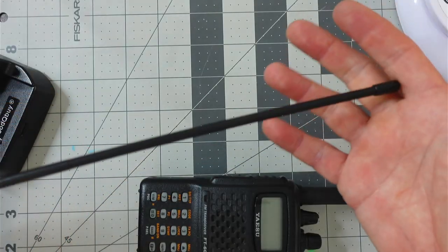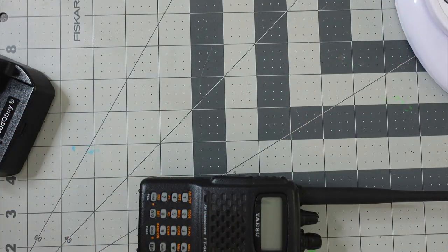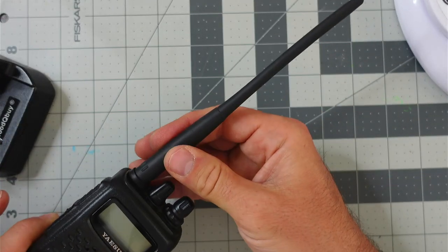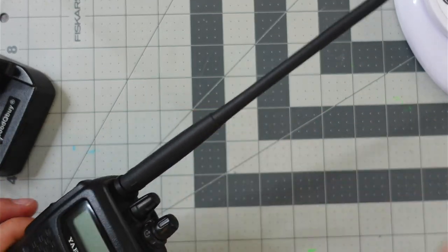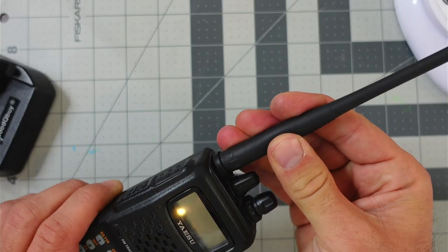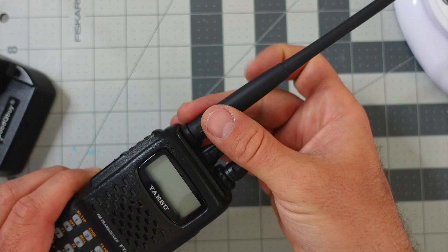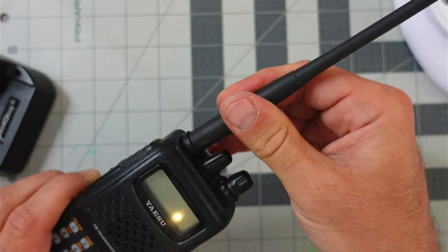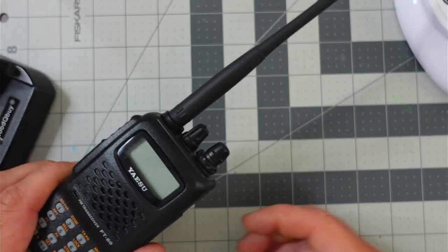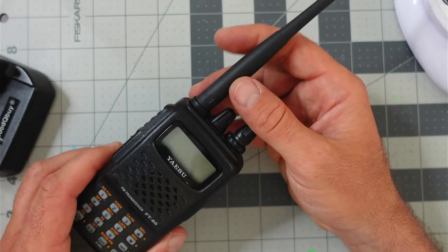This is a Redivis antenna that I've had pretty good luck with. I'm not tightening it so tight where it's super tight, because if you turn the antenna too much you could potentially break the SMA port. Just a nice little turn until it becomes resistive — you get the idea.